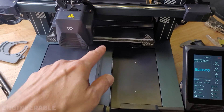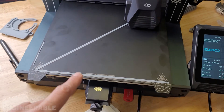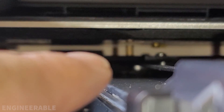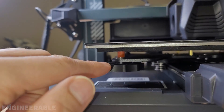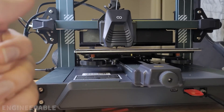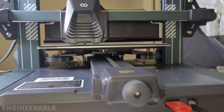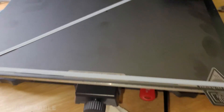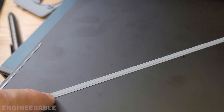For the first time ever, it seems to be building evenly across the whole build plate after doing that mod underneath — removing the belt ends that were pushing up into the insulation, adding a washer under the spring, bringing the springs down until they bottom out, and then turning one turn back before doing all the calibrations.